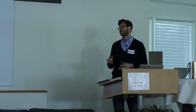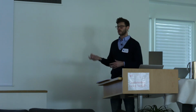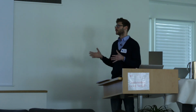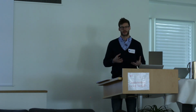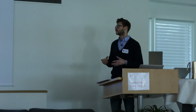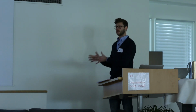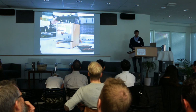Unlike traditional sample roasters, where you can buy one system that has up to 6 barrels in one, we have a module-based architecture. So you start with one machine. If you need more, you can simply add the capacity you need, and you can put them next to each other without interrupting the workflow of the system. That means that all the interaction with the sample roaster is from the front. There's no need to have access to the side panels or the back. This means that you can place them right next to each other in a line. And the chaff separator is also built into the system and is accessible from the front.